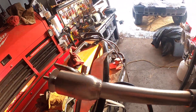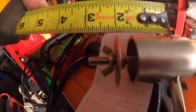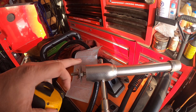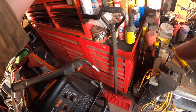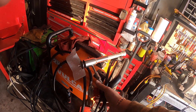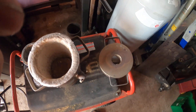I never change my burner plate or my air intake, so let me measure that real quick to help people. This is where I run mine — right around half inch, because I never change this. I got that set and it never changes. When I turn it on and off, I turn my regulator on for my gas; when I'm ready to turn it off, I turn the regulator off. I don't change anything on here. When you mount this, set it so it's slightly recessed.